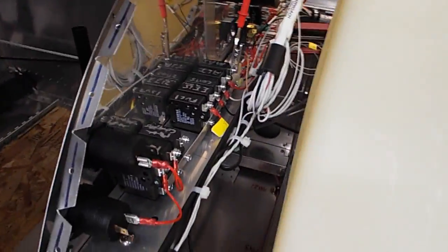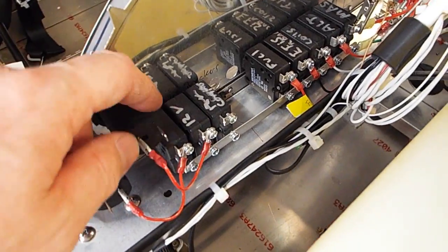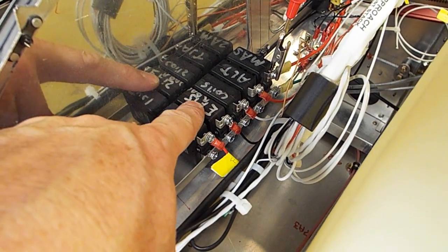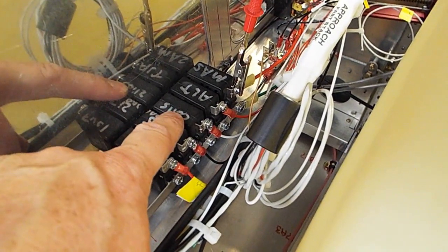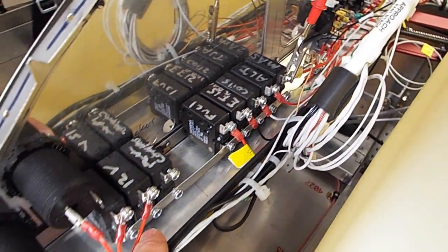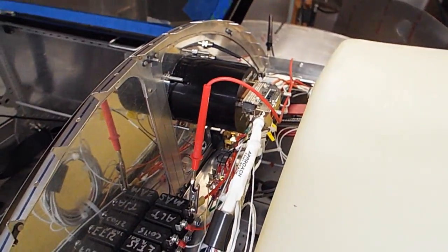So my wiring, I got a couple of USB and a cigarette lighter, spare one there. What was that? My EFIS, my compass, and my fuel. Oh no, fuel's right there. EFIS and compass. There's my coils. Here's my alternator. There's my master. And I just have one solid bus strip supplying 12 volts to everything right there. And that's my little MGL. Let's see what else.